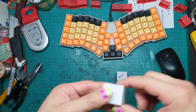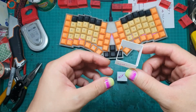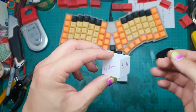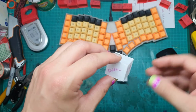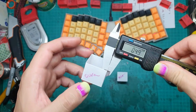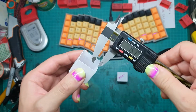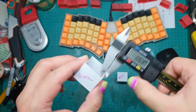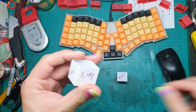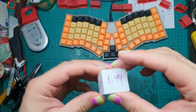And then you go and do the flow calibration on your slicer and do this typical test where you print a cube with no infill, no top, no bottom, just one perimeter, typically 0.4, so the diameter of your nozzle, and you measure it and you see how off you are. So 49, 48, 50, 50, 48. So this is about 49, right? So that comes up to about 20% off from the mark.